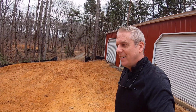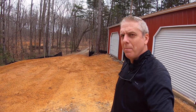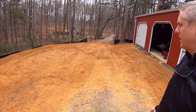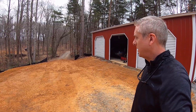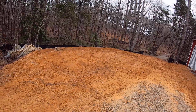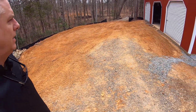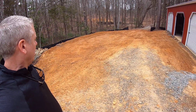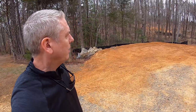All right, so I've finished up the grading for the most part. I'm probably going to try to touch up a few holes and just look around, but I didn't record all of it. It's just a lot of the same, but it turned out really well. Super happy with it. I don't know if you can see, there's still a few little dips that I'll go around with a shovel and fill in. I want to even out a couple little things, but it's just about ready for stone.